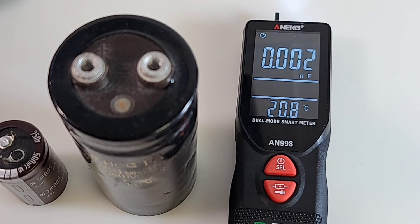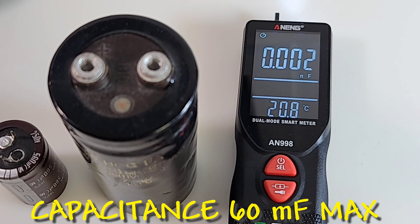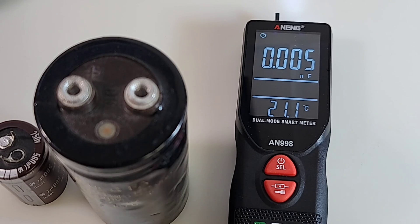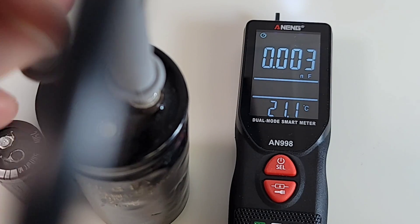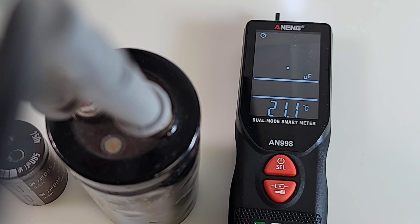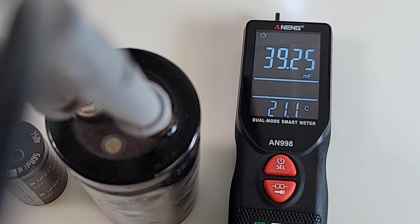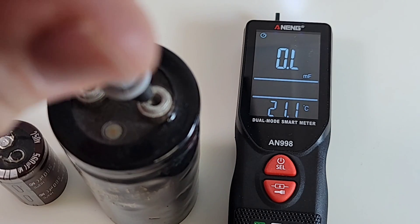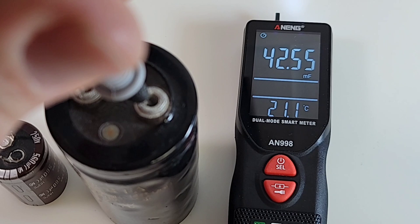For my capacitance friends - I know capacitance is kind of important so I do apologize if I neglect it. Testing capacitance with a nice 47-millifarad capacitor. This has a maximum of 60 millifarad (60,000 microfarad). It's thinking... we have that display at least letting us know it's in millifarad mode. Thinking, thinking... and there we are: 43.65. A little wavering - 42 to 45 - so I'll give it a hit: that works.